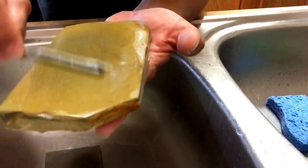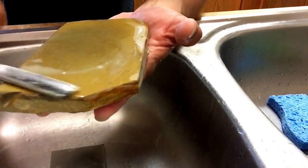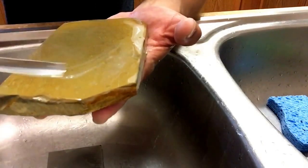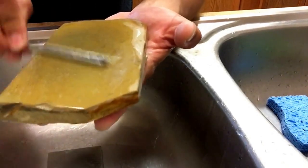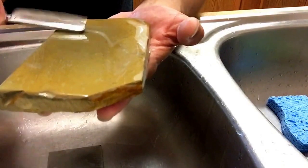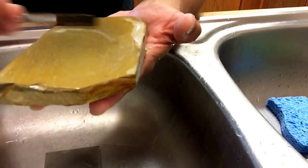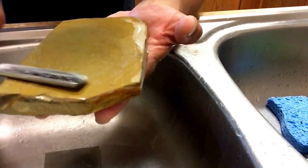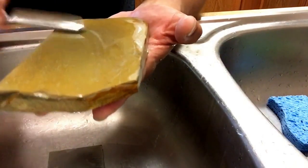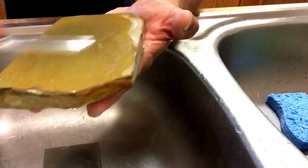So for me right now, I'm doing the work on the 8000, right? So we did the 5000 range, and now I'm doing weight of the blade only, letting the slurry work. And at the moment I'm just doing one single stroke. I do a bunch of strokes at the beginning. If I get bored, I might do some, but you don't have to. I like to do straight strokes towards the end anyways. Straight like that. Boom, boom.